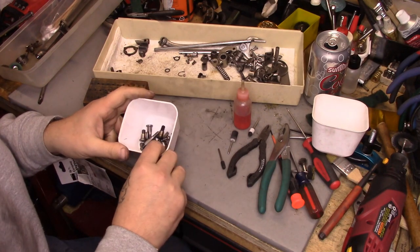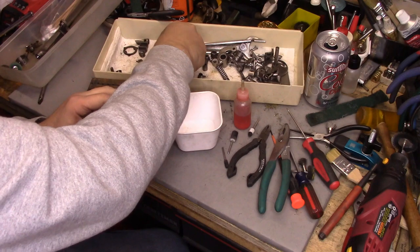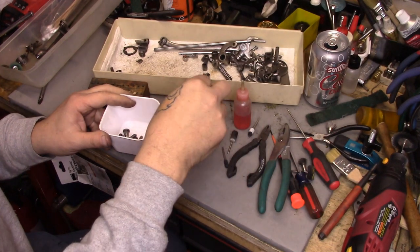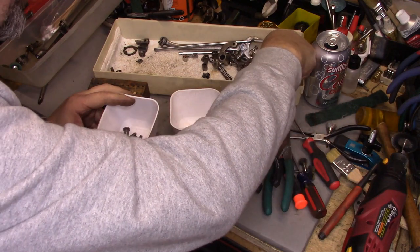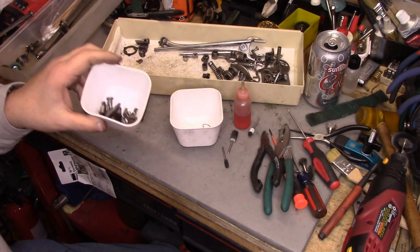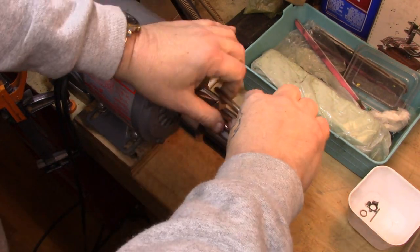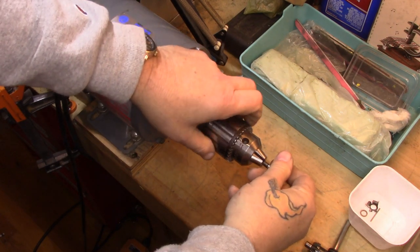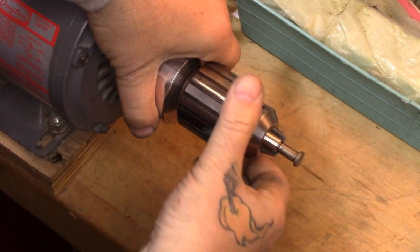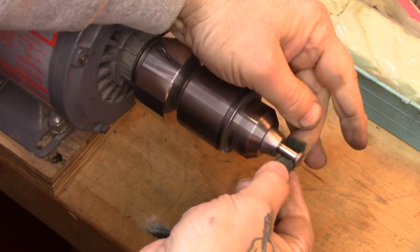Let me reset up at the bench motor — all the small completed hardware goes in that tray. It's a little cramped here now because I had to bring the camera over and an auxiliary light stand. I know I've shown this in the past. This is the screw that holds the stitch length regulator in place. Cleaning the shaft of that machine screw with some green Scotch-Brite pad while the motor spins at full tilt gets that shaft area nice and clean.